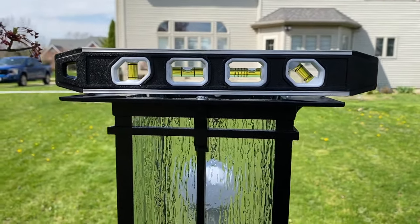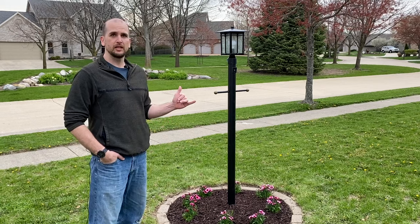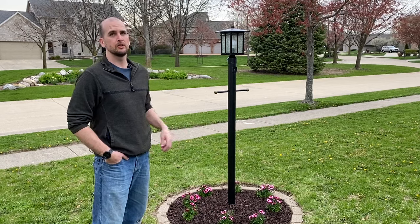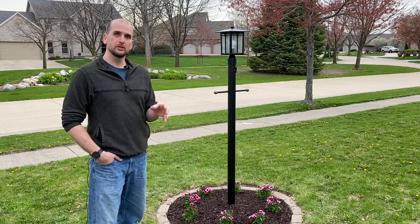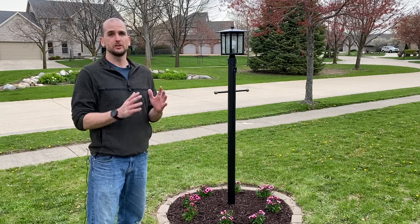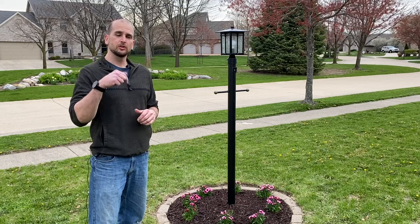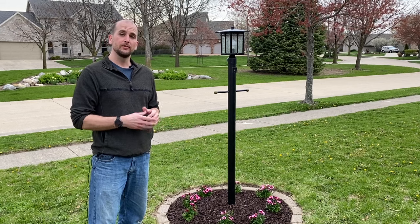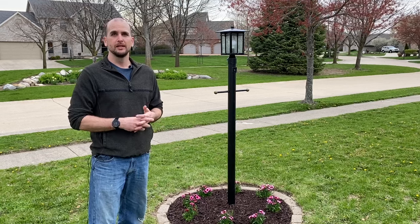Just finished up the project - overall it took about a half day. I got the post out one day, then later in the afternoon got everything set, put the quickcrete in, and let that set overnight, checking a few times to make sure everything stayed plumb and nothing shifted. Once it was really set, I came back out to mount the light fixture - you want to be careful drilling into the post if it's not secure, as you'll adjust it out of plumb just by mounting the fixture. If you have any questions on the products I used, look in the description for links. If you like these videos, subscribe to our channel and give us a like - we put out new videos like this on a weekly basis. Take care!